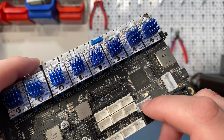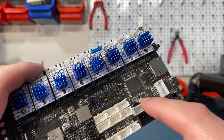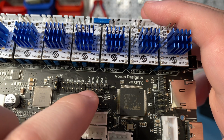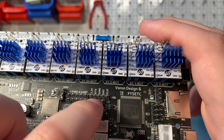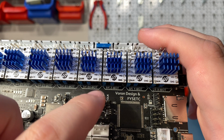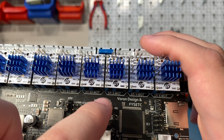And it just makes it easier for you to wire your CAN bus stuff, but you still need that. Don't just directly connect this to the rest of the CAN bus. Don't make that mistake. These bottom 4 pin headers, they are for the I2C bus, and the top ones are for just programming the STM chip. So if you have to do that sort of stuff, it's nice that they're available very easily on the board as well. So that's also a new nice touch.